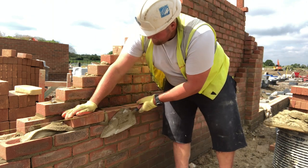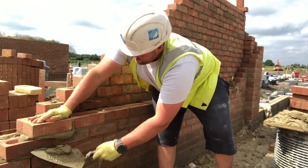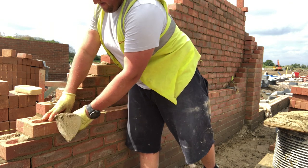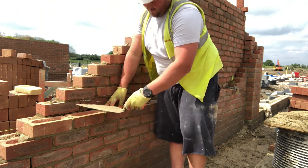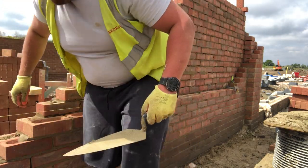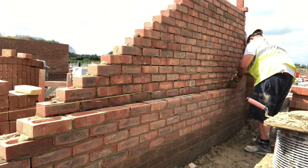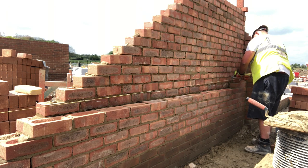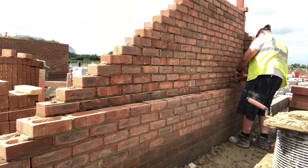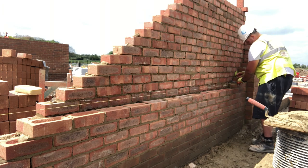When it comes to traditional, you can see me using the big trowel today as well — the 11-inch. I'm still getting used to it; some of my joints aren't filled as well as when using the 10-inch. I just can't get the mortar quite where I want it right now. A lot of the time it's because the trowel isn't worn in — it's got quite sharp edges, so it's getting them worn down nicely and getting it broken in. You have that teething period with all trowels. It's an 11-inch Marshalltown — got it from Toolstation for 32 quid on offer. Same price as a 10, so I thought why not, I'll try it out again. First time I used it, not gonna lie, felt like I was gonna break my wrist.